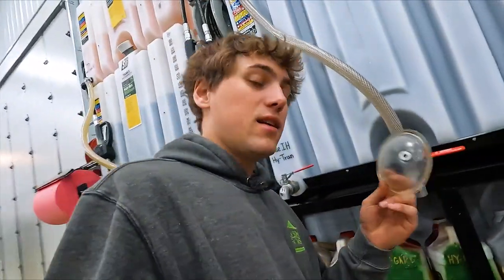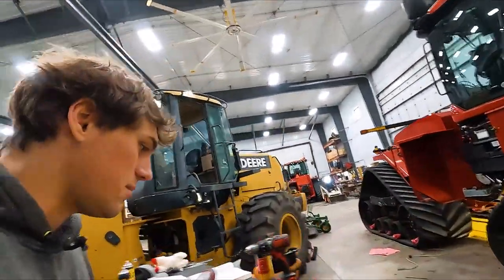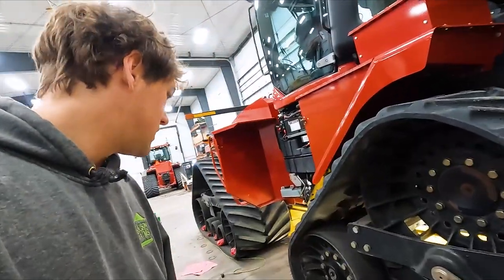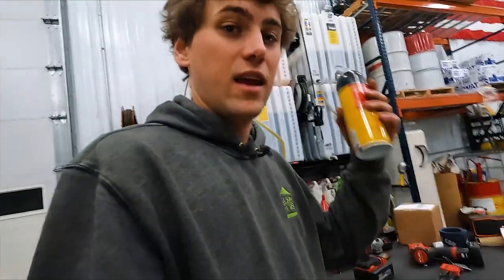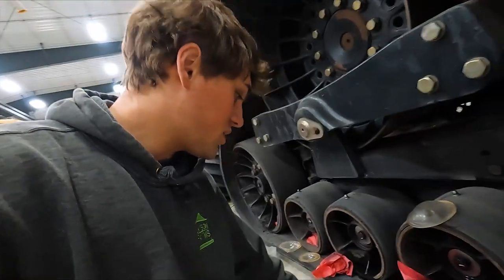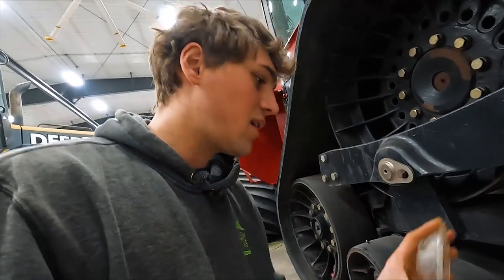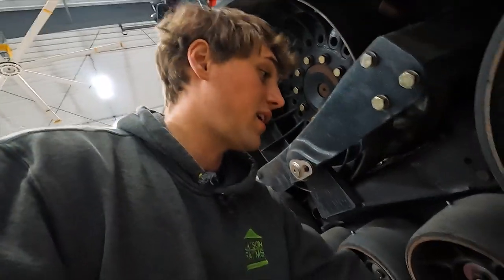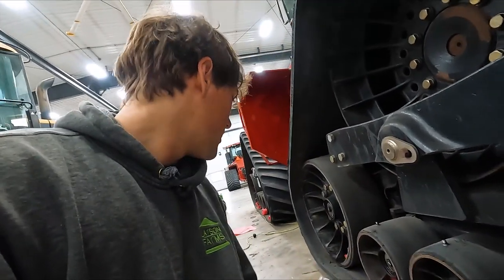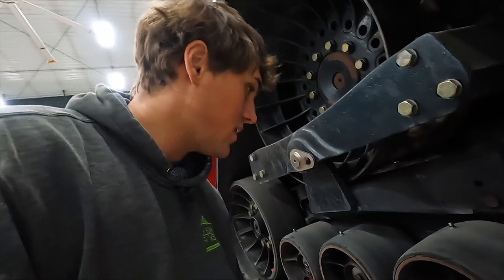So, I just got done cleaning for an hour all the caps and O-rings. So that job's done. And I'm short on brake cleaner. I normally shoot brake cleaner in where the snap ring goes, clean that all out. I gotta go on the hunt for some because I got half a can left. So now it's just the reverse job, putting them on, which is pretty simple. I always take the plug out, or air gets trapped in there, and it becomes a real son of a gun to try to get the snap ring tapped back in. So it works way better to have that plug out, and then the air can escape as you pound it in. So let's do it.